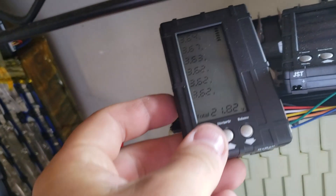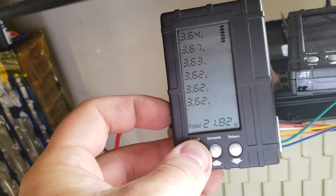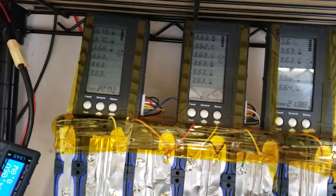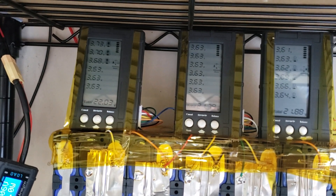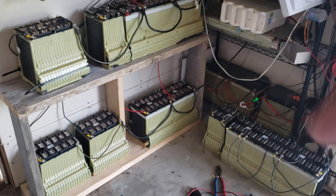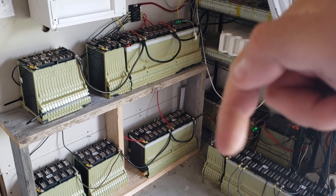The Mobius batteries don't stay as balanced as the Chevy Volt batteries. The Chevy Volt batteries were only about 0.05 volts difference from each other, and these I don't even have actively balancing — that's just the way they are. Whereas this pack, if you see some of the voltages are higher, and I have to balance that pack the whole time, which is kind of a pain. But anyway, I wanted to give you guys an update — if you have any questions or comments, drop them below!